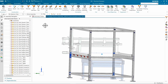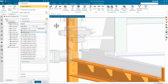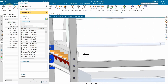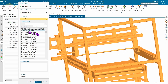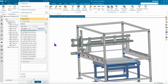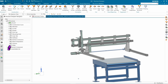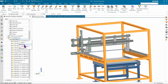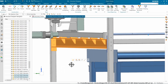The last two enhancements are for the consolidate command. Enhancement number 9 will allow you to add components outside of the structure into your consolidated list. So if you have components like small mounting tabs, those can be added to the consolidated list and later added to a weldment. First, consolidate the assembly as you normally would, but notice the option for Select External Components. Then simply pick whatever component you want — here we'll pick these small mounting feet. These components will eventually get welded to that top rail and drilled and tapped. With this new enhancement, it's easy to create a very detailed weldment of things in your structure and external components.